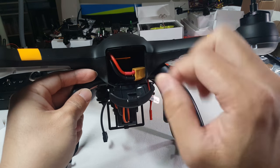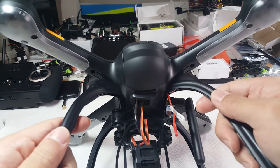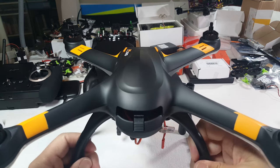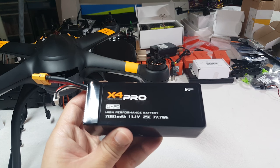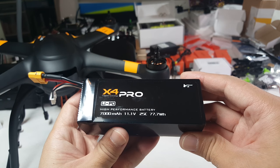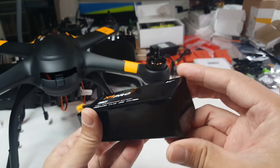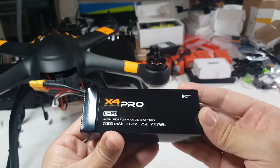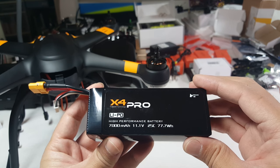You've got a set of LED lights under the motors — there are four of them. They indicate things like whether you need to do compass calibration or whether you have a GPS lock. Here's the battery that it comes with — it's pretty big: a 7,000 mAh 3S battery. The Phantoms run off a 4S battery, so this is a little unusual, but it should give good flight times around 25 minutes. It'll take a couple of hours to charge, and they only give you one battery. GearBest does sell extra batteries if you want more flight time.